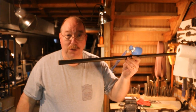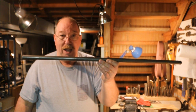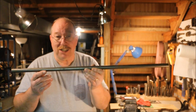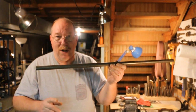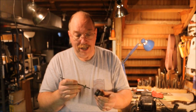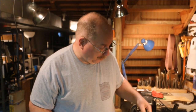I want to cut down a piece of this 3/4 inch bar stock to make the arbor out of. And I've got one little problem — this one won't go through the back of the lathe. The bore on the headstock is big enough to handle it, but I don't have enough room behind the lathe, and that means if I stuck it in the chuck I'd have too much hanging out on the end. So I'm going to mark out the size piece I need and chop it off. I'm going to make two arbors — one for myself and one as a spare. Making a quick check on the depth of the thread — the bottom of the pocket is three-quarters of an inch deep. So I'm going to put a three-quarters of an inch stub on the end and thread it down to 3/8-24.